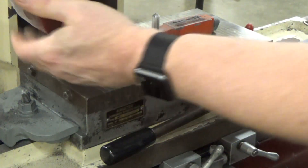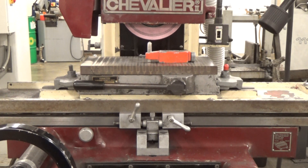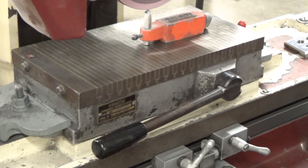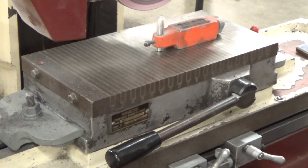The faster you go, the rougher it's going to be, so just a nice cross. As you can see here, it's clearly just slightly left of center with the diamond. If it were on the right and for some reason it kicked in, it would leave a big gouge in the wheel — or could actually blow up the wheel, which I've seen happen and it scatters things everywhere. Once you've got it dialed in, move it across at a nice easy pace like you're seeing here. Once it's done, just move it up out of the way.